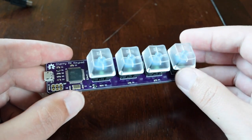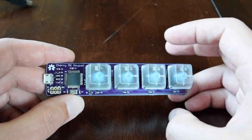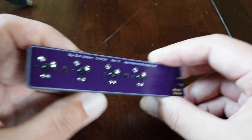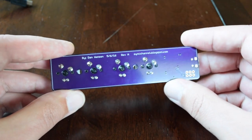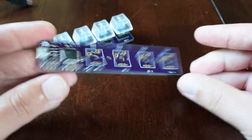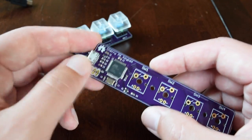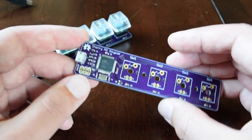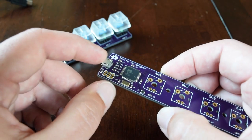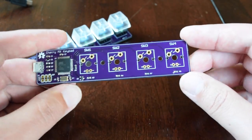If you're interested in assembling and making one of your own Cherry MX custom keypads, this is a shared project. Click on the link to the blog post article in the description of this video — that'll take you to my blog where I have all the information from this video and all the design files, which are shared on GitHub. It is already uploaded to OSH Park as a shared project, so you can order PCBs right now. This is what the PCBs look like. It is a surface mount design, so keep that in mind — make sure you're comfortable doing surface mount soldering before you attempt to assemble your own. There are a couple of parts that are a little difficult, particularly the crystal and the USB connectors, so take a look at the images of the board and the design files before you order boards.